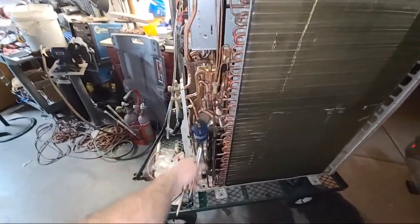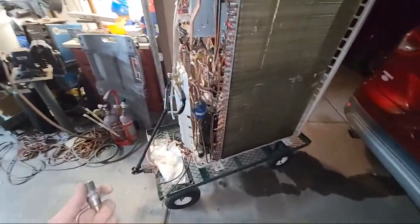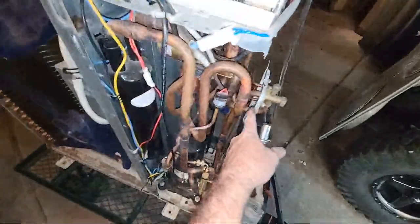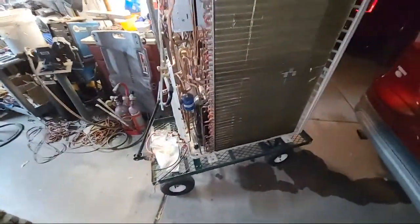The other thing — I woke up the other day thinking, oh shit: when I first re-piped this and gutted the four-port manifold with the four expansion valves and everything, I realized I gotta put an expansion valve in for heat mode. I retained the reversing valve and all that stuff this unit came with, but I just re-piped it with a scroll. For those that need to catch up, I just made it a single-port unit — it's only three tons, real tall and skinny.